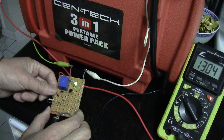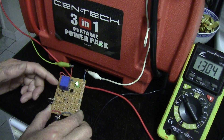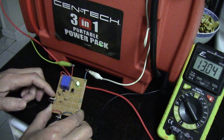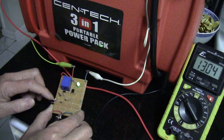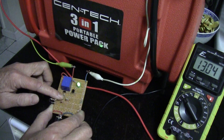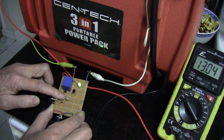After you build this, just make sure no component gets too hot to the touch. If it does, you have to increase the resistor value — I have a 100 ohm half watt here; if it gets too hot, switch it to 1 watt. Same for the Zener diode — it's a little warm but you can hold your finger on it, so it's not too hot.